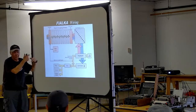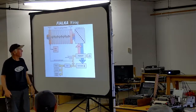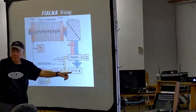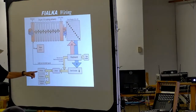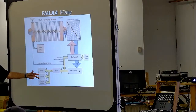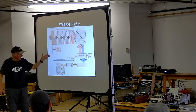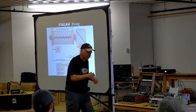The 30 characters go into not three, not six, not nine, but 10 coding wheels. The Fialka has 10 instead of three coding wheels. And to make things even more incredibly complicated, each of these wheels goes in a different direction — some wheels going back, some going forward, alternating, just unbelievably complicated. There's a reflector at the end and the 30 characters come back out through the keyboard switches. But then they go to a five-bit encoder like a teletype machine and a current driver, which then activates an electric printer capable of punching holes in paper tape and keying into an external transmitter.